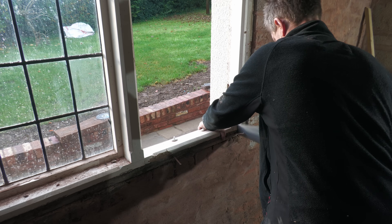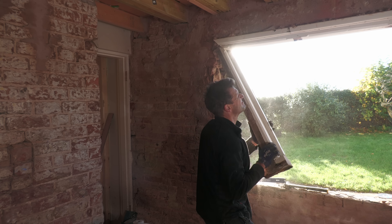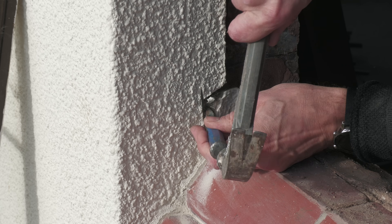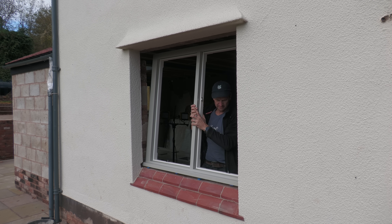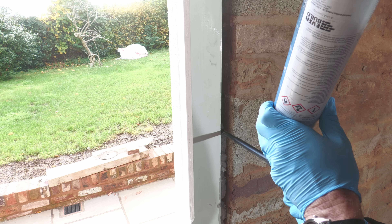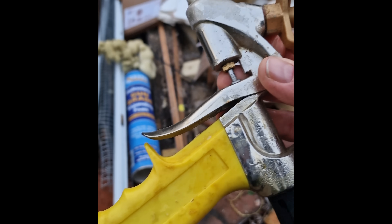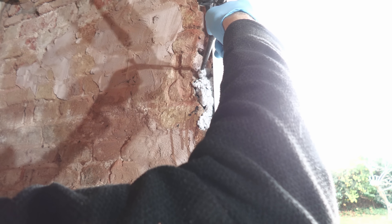With the painting complete I moved on to removing the old window. I've done at least one video on window replacement so I won't go into too much detail, but suffice to say it's a case of removing the old glass then the frame. I then needed to tidy up the brickwork beneath the window and apply a watered-down coat of PVA as I'll be putting a render bead in shortly below the sill. The old windows didn't have sills, which we decided to install as this side of the house is south-facing and gets pummelled by the weather, so the Tirolean needed notching to make way for the sill. I precisely positioned the window with a spirit level, tape measure and glazing packers, then fixed it in position with expanding foam. If you haven't already got one, get a foam gun — it gives you so much more control than the spray cans. Make sure it's a non-stick gun.